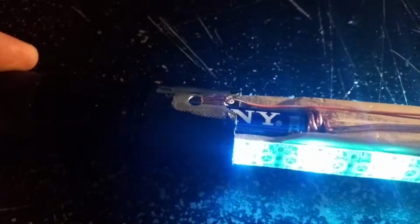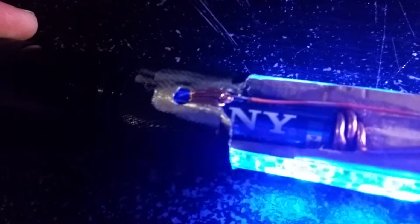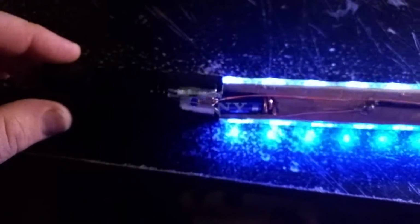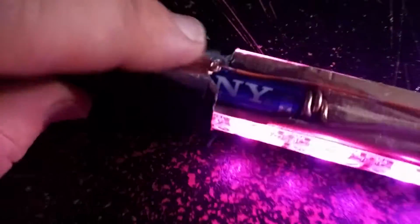The aluminum versions of those flashlights, the cheapy little Harbor Freight LED flashlights, they're not crappy, they're actually not terrible, they're just cheap. The aluminum is used as the conductor that gets it down to the LED lights, so all you have to do is make a connection to the housing of that, and she turns on. So that's power in. Positive lead comes over and connects to the aluminum housing there.